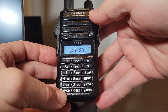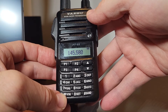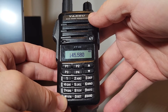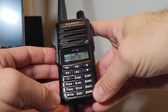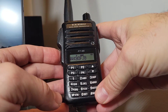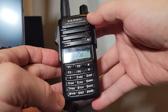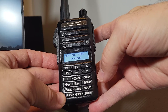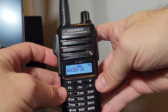Quick final review: the radio comes in VFO mode with a random frequency and no information available. You can find repeaters in your area by downloading the Repeater Book app, which uses location services to find nearby repeaters. Use the band key to distribute your memories to various banks to keep everything organized. When needed, you can initiate a transmit CTCSS tone or another squelch type by holding the function key briefly, hitting P3, and selecting the squelch type you need. That will get you on the air. I hope you enjoyed this content and will join me again next time.